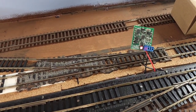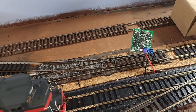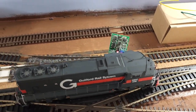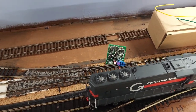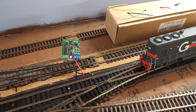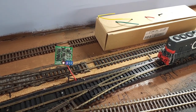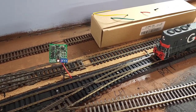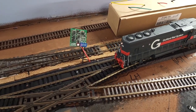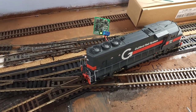She's all wired up — we've got power. Wired so the frog should be all set. That LED should change color depending on which track the locomotive is going down. We're going down on the main line right now. Speed step one — the LED is still red, so I'd imagine when I go down the spur track it should change. We'll find out in a couple seconds. I put the switch in reverse. Speed step one — it changed to green. That means I wired it up correctly.